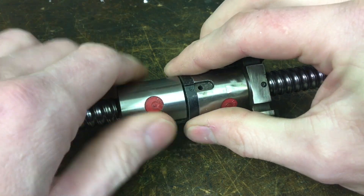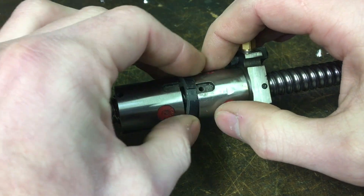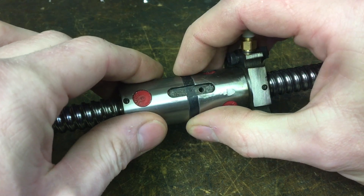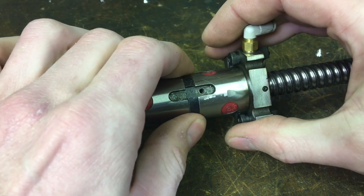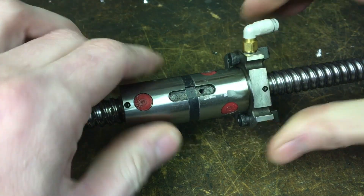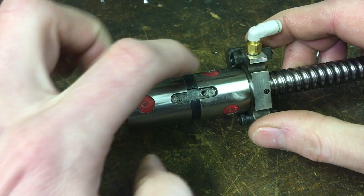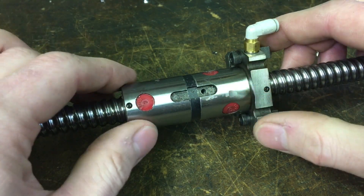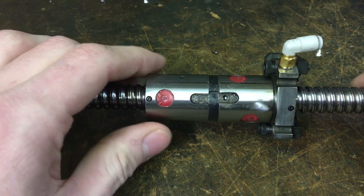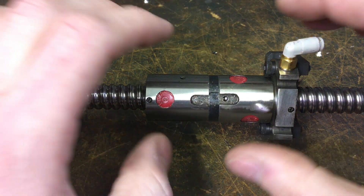This is one of the factory spacers that came with this screw. I wanted to demonstrate sort of what's going on here. As you can see, these time up pretty close — that's with a little bit of preload on it, it's nice and snug. But you can see the discrepancy between this flange nut and then the second one here — how they're out of time.